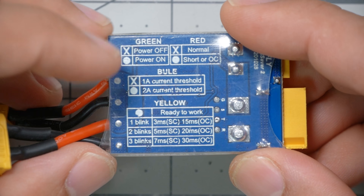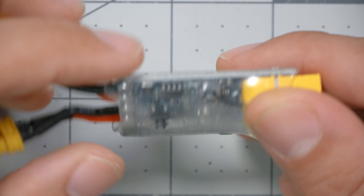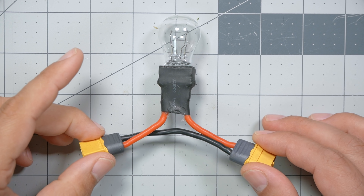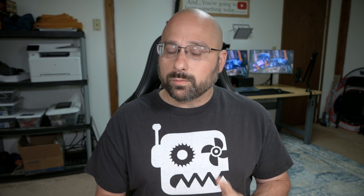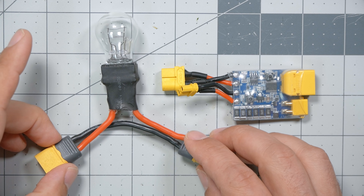On the back of the V-Fly, you can see a marking — it has either a 1-amp or a 2-amp current threshold, selectable by pressing the button. We were on the 1-amp threshold, and those motor startup beeps just happened to pull more than 1 amp and tripped it. On a 4S battery (about 16–17 volts), the light bulb allows about 3 amps to flow. This is a significant difference between electronic and light bulb smokestoppers: the electronic one cuts off entirely when it trips, whereas the light bulb still allows 2–3 amps to flow. These light bulbs are rated for up to about 4S — on 5S or 6S they just blow, as they're made for 12-volt car batteries.